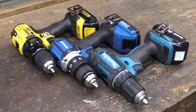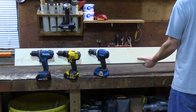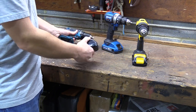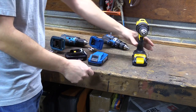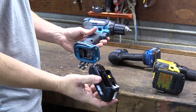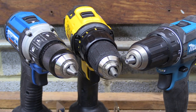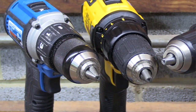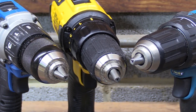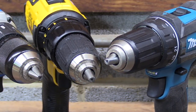The construction of each has a standard colored hard plastic design with a rubber overmold grip and rubber bumpers built in to prevent damage to your work surface as well as the drill if you drop it. Each of the batteries are on a slide rail system — press the button on the front to release the battery, then slide a freshly charged pack in place, and when you hear the click, it's ready to go. The chucks on each are all a half-inch keyless ratcheting version, however the Hercules has an upgraded metal sleeve design, which is a Jacob's Chuck. The DeWalt also has a Jacob's Chuck but with a plastic sleeve design, and the Makita has a Makita version plastic sleeve design.